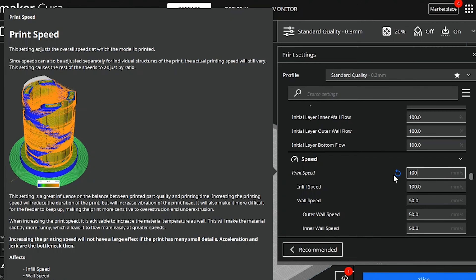So there you have it — two awesome plugins that can help you streamline your Cura Klipper experience. There are plenty of ways to customize Cura for Klipper, and in my experience the things I went through in this video are the most essential customizations — the most useful ways to really get Klipper and Cura running smoothly together. But this is just the tip of the iceberg; there's a whole ton of other stuff out there. Now for that little tip I promised: just increase your print speed by 50 millimeters per second until you hit that sweet spot.